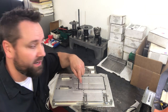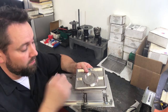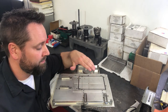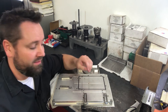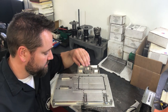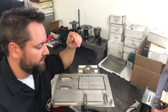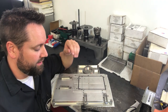It's pretty wild how well this pulls the part down. I had some — this one is 3/16" stainless steel bar material and it was relatively stable. But some other parts I made were out of 3/8" plasma cut plate and they had all kinds of stress in them. After you would machine it, this thing would actually hold that stress down and keep it flat. Then once you released it, you would see it spring up — that's how well it was pulling it down. I've got nothing but good to say about it. If you were going to do something like this, think about maybe going with a thicker plate. But if this is in your wheelhouse and it's something you think you might need, do not hesitate — it's a fine product and I'd highly recommend it.